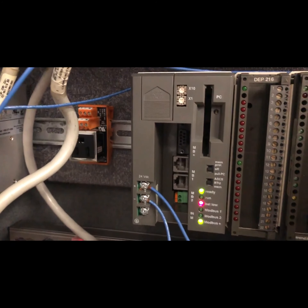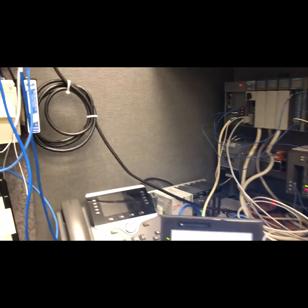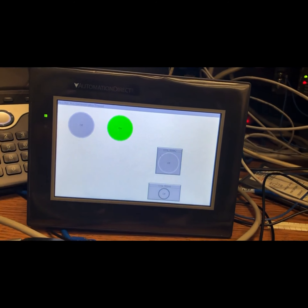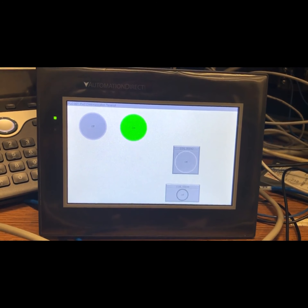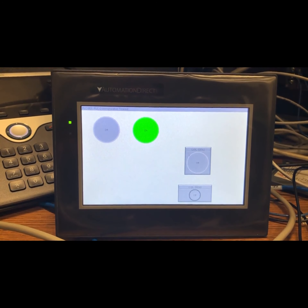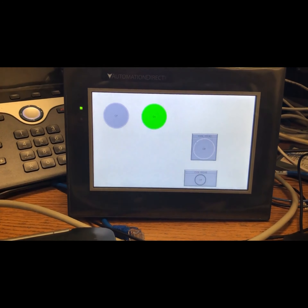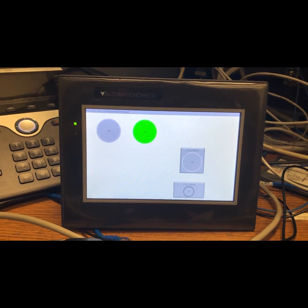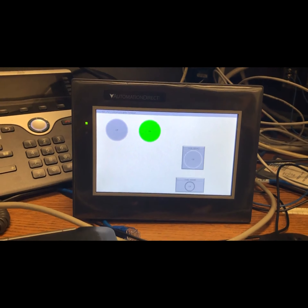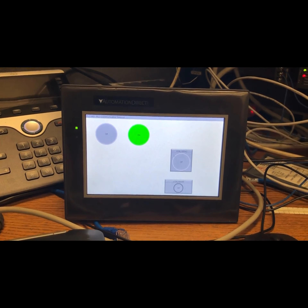This other compact over here has RJ45 Modbus ports — ports one and two — plus a Modbus Plus on a 9-pin, so that one needs different cabling. The Automation Direct unit is an E9-T7CL-R. It's kind of the base model of their E9 series — not low quality, just fewer features than the T7CL without the dash-R. That version has three serial connections and supports things like Data Highway Plus. This one supports RS-485 and RS-232.